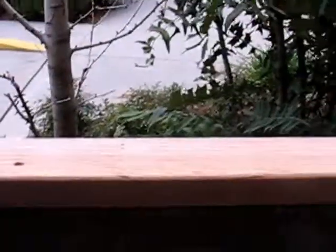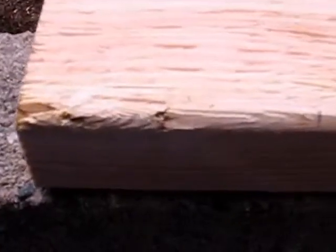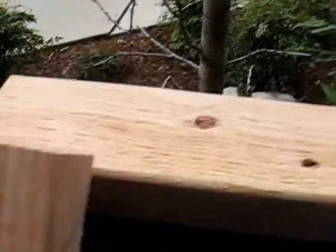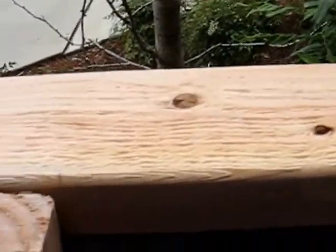And so what I've done is I've taken one of the 4-foot wide pieces, what I was calling the horizontal supports. And I don't know how well I can show you this. I've got a couple of pencil marks in there. Basically there's actually 2 kinds of horizontal supports, but we've got this which is going to run along the wall, not exactly in this position, and then I've got the other 2x4s which are going to run perpendicular to that. So I've just basically mounted this at the top of the wall because it's going to be really easy to screw these pieces together.